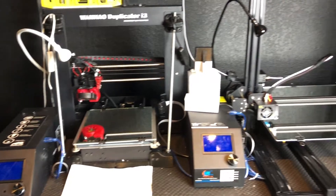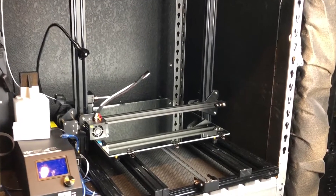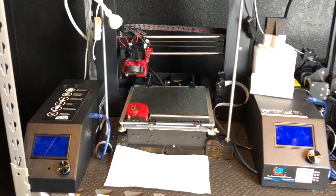I wanted to use a glass bed like the one that came with my Creality CR-10 S5, but I can't get anything to stick to a flat piece of mirror. The good news is that for the S5, which is a 16x16 plate, it was seven dollars for the glass mirror piece, and the Duplicator i3 is like eight by eight — that was four dollars. You can clean it with a razor blade, with acetone, doesn't mess it up — but if you can't get something to stick to it, that's the whole point.